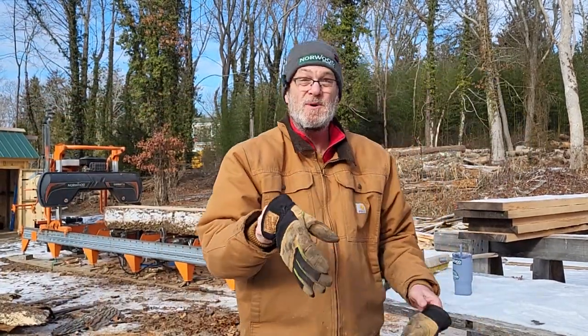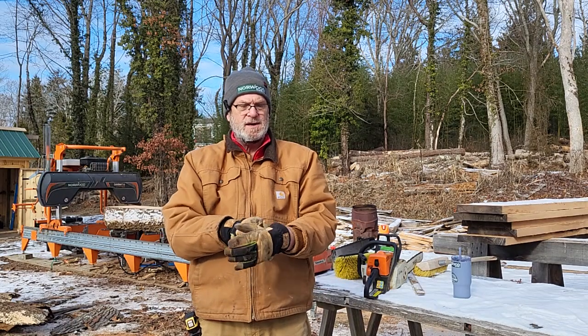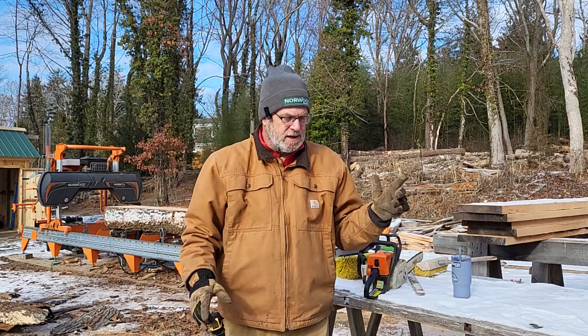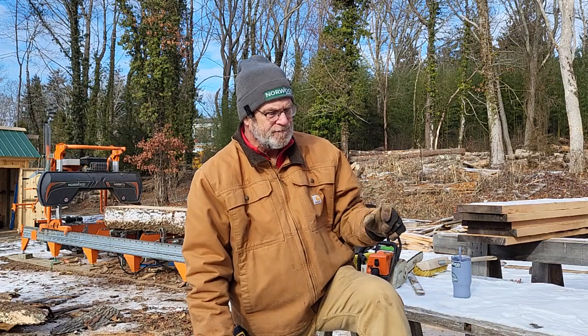I'm going to show you what's going on. We had a couple of developments since you've been gone. I did hit another piece of metal because I saw black staining near the piece that I hit in the last video. If you didn't watch the last video, watch it. I tried to dig it out and I couldn't find any. So I said, you know what, while this band is roached, I'm going to take a flitch off this side. And I took a 2-inch flitch off because I needed to get rid of some wane anyway.